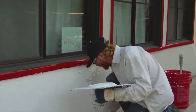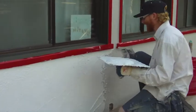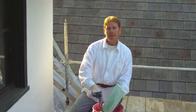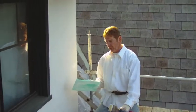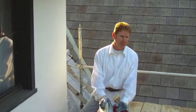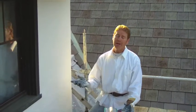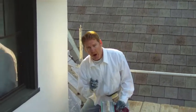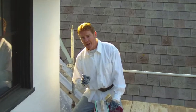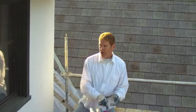We'll finish floating and spreading out the rest of the wall, then I'll grab the float. Alright guys, we are complete with this. Good rule of thumb: we're spreading an acrylic Parex finish. It's early morning, the sun's just starting to come up. There's a chance of rain this evening or anytime tomorrow — I would not be applying this Parex acrylic in those conditions. There are other acrylics I can apply, but Parex takes about 48 hours to dry.